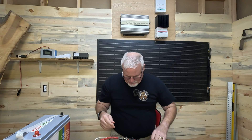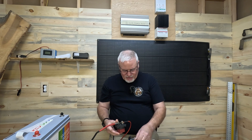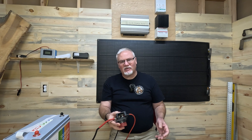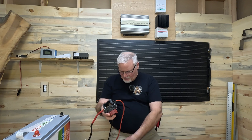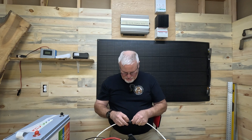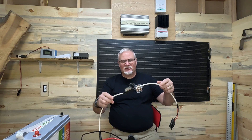You can now change that out to an XT60 or an XT90. This switch here comes with all the parts necessary to build it onto a platform — maybe a cart you want to transport around. I really do recommend one of these little fuse boxes: it has two lugs and you just connect your fuse between the two lugs, then run your cables to it, and you're done. That's all there is to it. I hope I helped somebody out today — appreciate you watching. Y'all have a great day, the old Jarhead out.